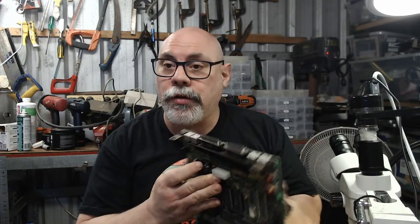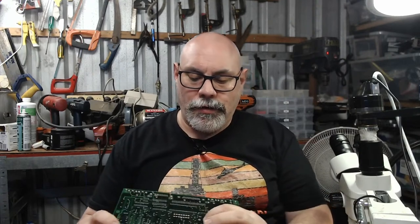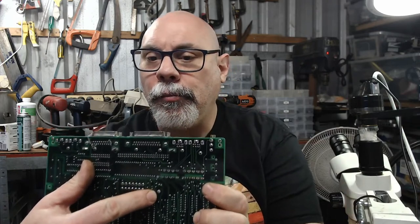Okay. On the SE logic board, by the battery, there's a round hole between the battery and C13. Now, is yours a soldered-on battery or one with a battery holder? Because there are a couple of different versions of the SE logic board. Well, I suspect yours is a soldered-on battery. Are you talking about this big knob there?